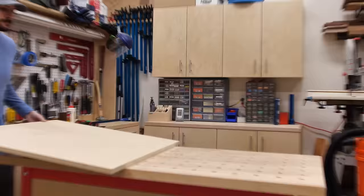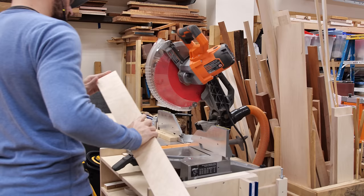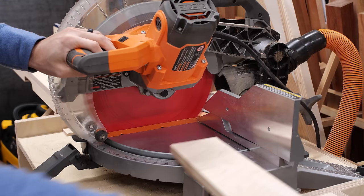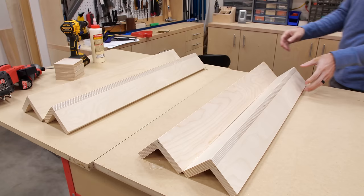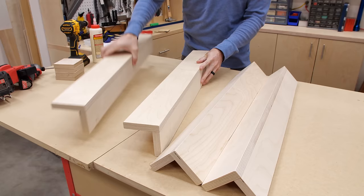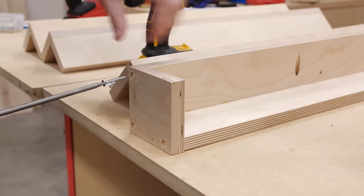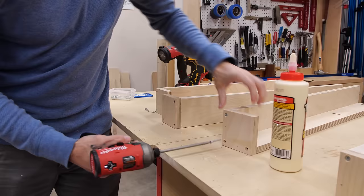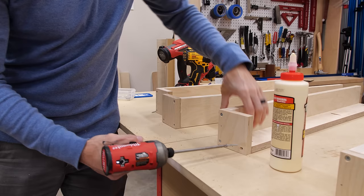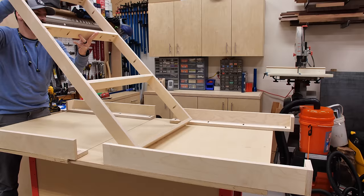Just make sure that the ends are flush so there won't be any mismatch with the top. I brought over larger pieces of MDF to increase the size of my workbench top — and this is exactly why I need to build a new assembly table that's wider. I love having mobile workstations so the outfeed table is going to get casters, and to give the wheels a mounting spot I cut some three and a half inch square blocks out of leftover plywood. Before attaching the wheel blocks you can pair up the legs to get them exactly how you want them to look. I used glue and two brad nails to temporarily secure each block, then came back with a countersink bit and secured them with one and a quarter inch screws. Make sure you pre-drill into the leg because if you don't you're likely going to split the plywood since you're going into the edge.